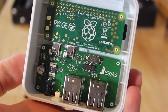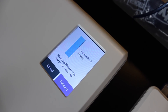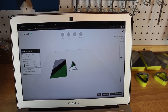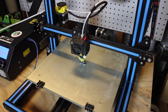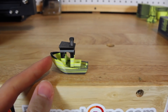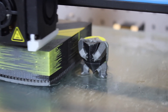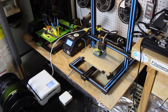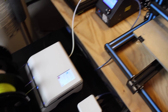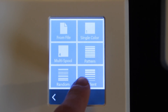There were a few problems along the way. When I unboxed the Palette 2 it asked me to update firmware, but following the website instructions it always failed. I had to take apart the entire Palette 2, get to the main motherboard, use a shunt jumper to short two pins on the PCB, and install firmware three times — nobody should have to do that. Also, the Canvas Hub is just a Raspberry Pi Zero, which is underpowered — it takes over 10 minutes to boot up and can't supply enough power to run a webcam or other peripherals.